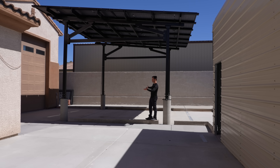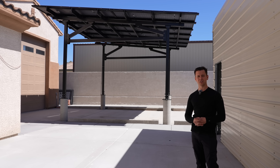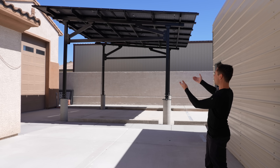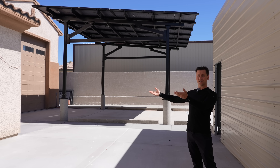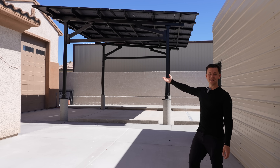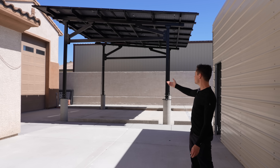I've never been able to use this part of my property because it's so hot. When I was planning this system I really thought I'd have more bifacial gain because the panels are lifted up so high, but if you have a dark environment behind them it doesn't seem to make much of a difference. We're not even pulling STC right now, and we might in a couple of months, but at my latitude we're just not doing it today.